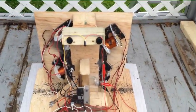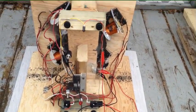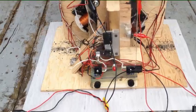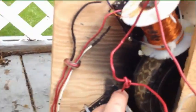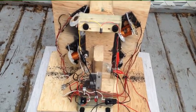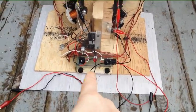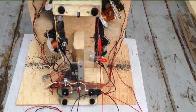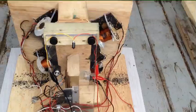I'm also going to try hooking up a single-trigger, four-power-coil pulse motor — one trigger driving four slave power coils — a Bedini SSG style setup. The inner hub is actually hooked up to two fan hub motors, one on each side to hold the wheel, so there's an actual output there. It's just driving an LED and only gets up to about five volts on that output.